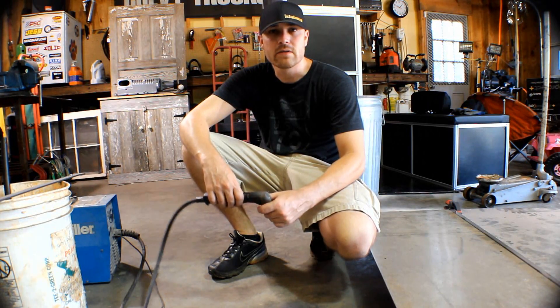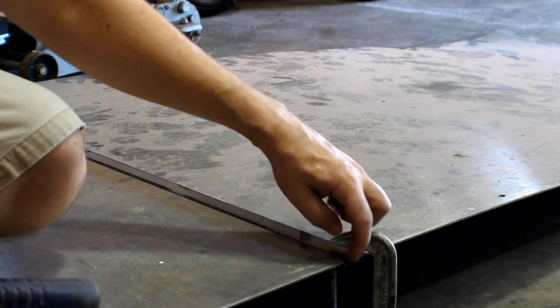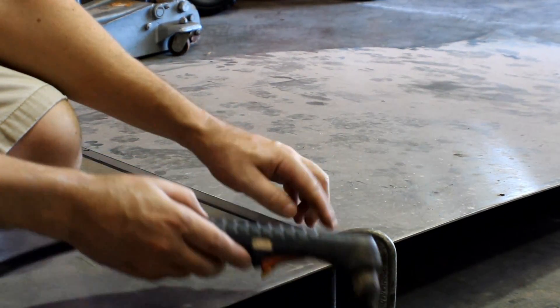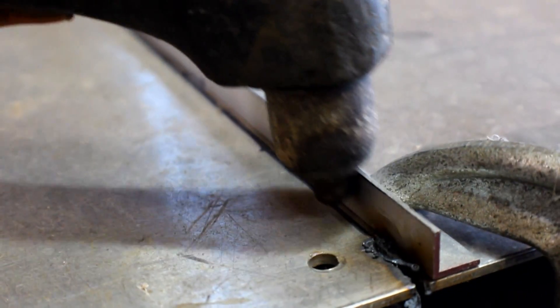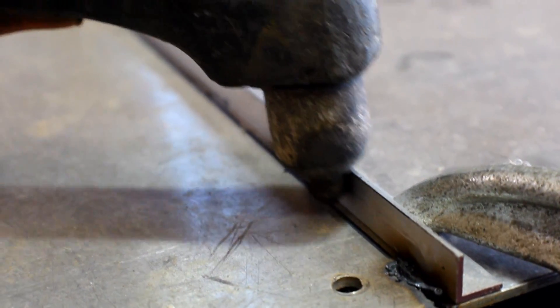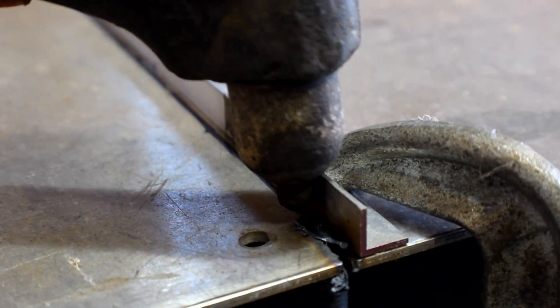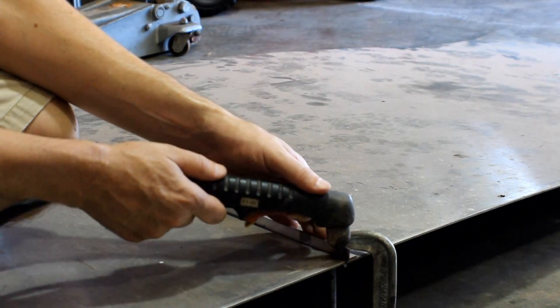Today's Fabform's quick tip: when you use a plasma cutter, use small pieces of aluminum angle to guide it. Find the perfect height aluminum — I got this at Lowe's. The plasma cutter sits right on there, and between the tip and where you're actually cutting, there's about an eighth to a quarter inch of space, which is perfect. Lay it on there and you're ready to cut.